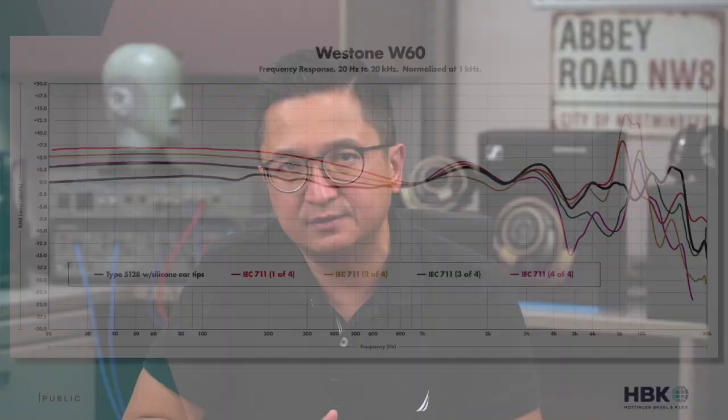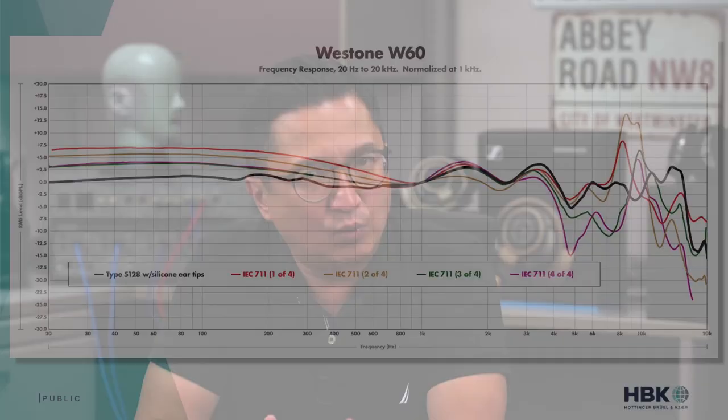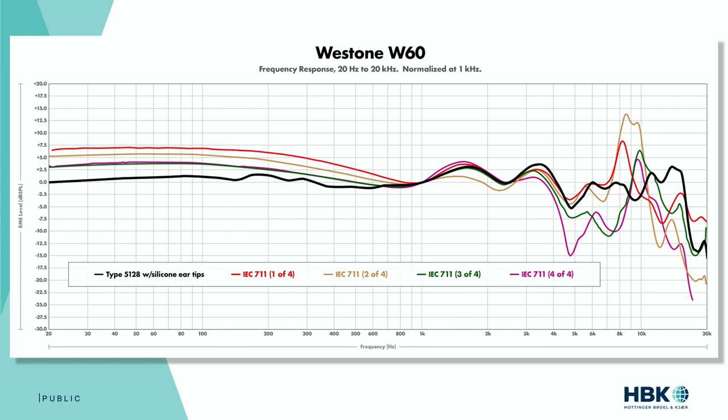Please also note the difference in the bass and even in the mid-band — particularly the 5128 compared to the 7-11 measurements — because this brings us back to more specific discussion about ear canals. When measuring some headphones, and perhaps even more commonly when measuring in-ear headphones, you will often see higher measured bass levels on 7-11 simulators than when measuring the same headphone with the 5128. When I saw this happening, my first suspicion was poor coupling — a poor seal between the earphone and the 5128's ears. With the earphones this was happening with, though, no amount of dismounting and resealing would close the gaps in the bass and mids.